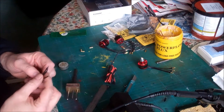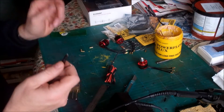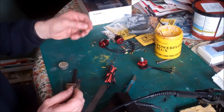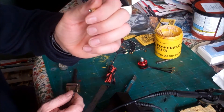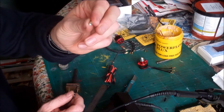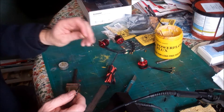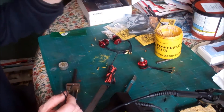I've taken three bullet connectors off the DJI motors. I expect they use what Bruce on RC Model Reviews calls hippie solder — the lead-free stuff. As you can see, there's a good amount of solder in there, they filled it right up. I don't know if the remains of the flux that they use is corroding at all. Sometimes I'll really heat that up and shake it out so I can use it again. But I'm going to use some fresh bullet connectors and re-tin these with good old lead-based solder.